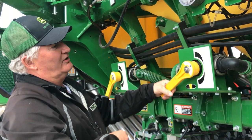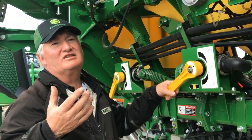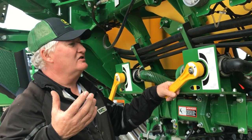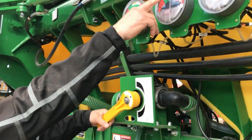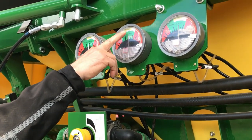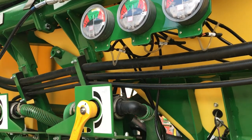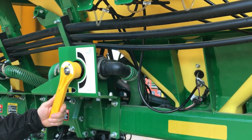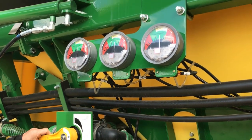What you'd be doing is throttling it with the fan running. We don't have the fan running on the machine right now because of the noise it would make during the video. So that's a picture showing the fan is running and we're pressurizing. With canola, you're going to adjust for the lower level of pressurization so we're not blowing the canola away from the roller with too much pressurization. Then you make that adjustment, get it where you want, and it follows.